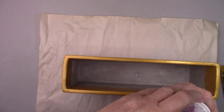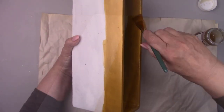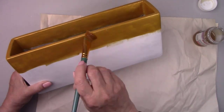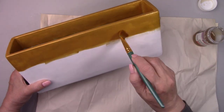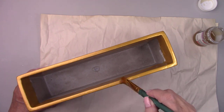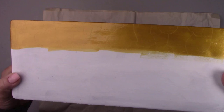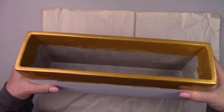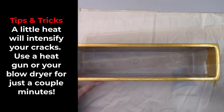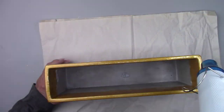Component one is dry now so I'm adding component two. This is an amber color, so put it on in thin even strokes. If you get buildup or drips anywhere you'll be able to see it when it dries. That will take about two to three hours to dry. Once dry you'll be able to see all the cracks. I'm using a heat gun for a couple of minutes to get more and deeper cracks. From here on you can only use solvent-based products on top of the crackle — anything water-based will ruin your crackle finish.